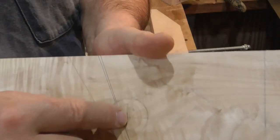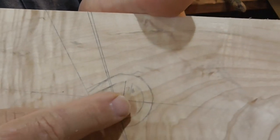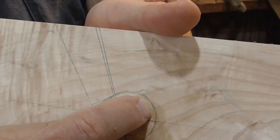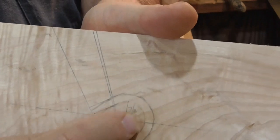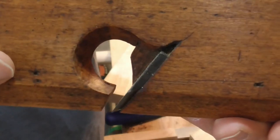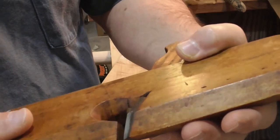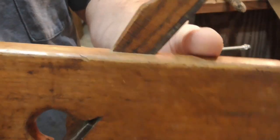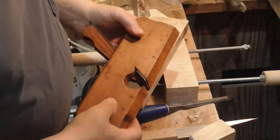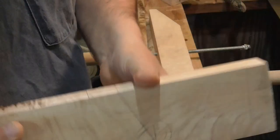Basically what I'm going to do is bore a hole all the way through, then bevel it from the perimeter of the hole back to the outside perimeter to create a bevel — which is pretty much the way the original looks. Everything else is pretty standard: a 10-degree tapered wedge. I copied the bed angle off the original. I want to film this now because by the time I get back to it, I'll be way past this point.